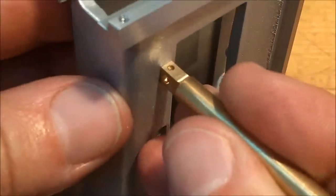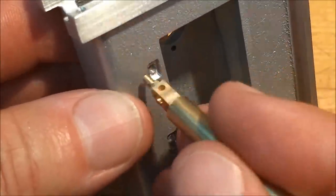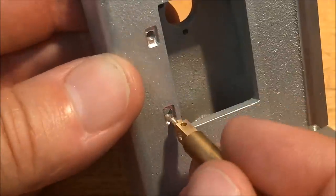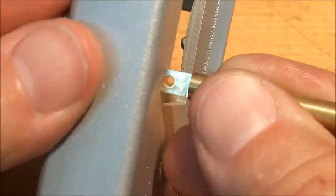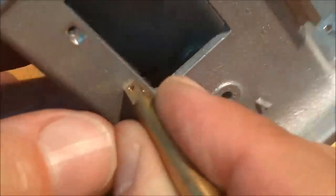The 45 degree cut on the bottom worked out rather well for clearing those radius features in the corners of these pockets. That was real nice. And I will not lie to you, I did have to take a file and hit the bottom hole just a little bit. I don't know if it closed up from the pressure of the milling or what the story was, but there was a bind point there. Not anymore. I am very pleased with that.